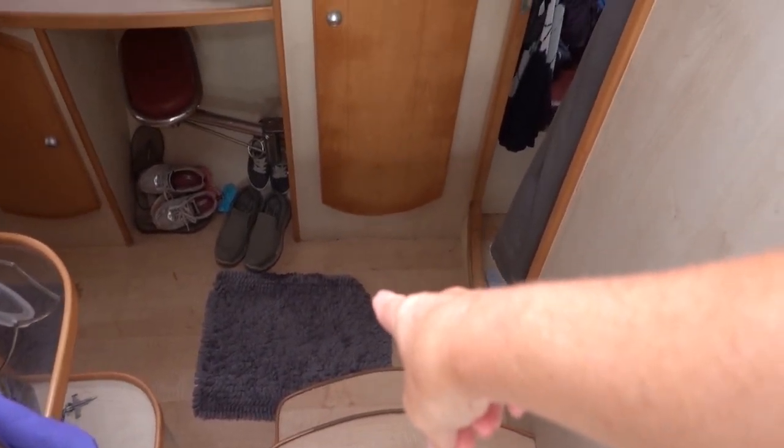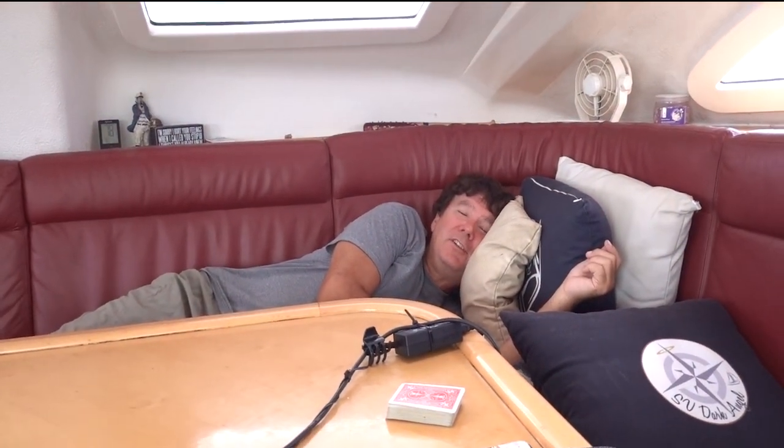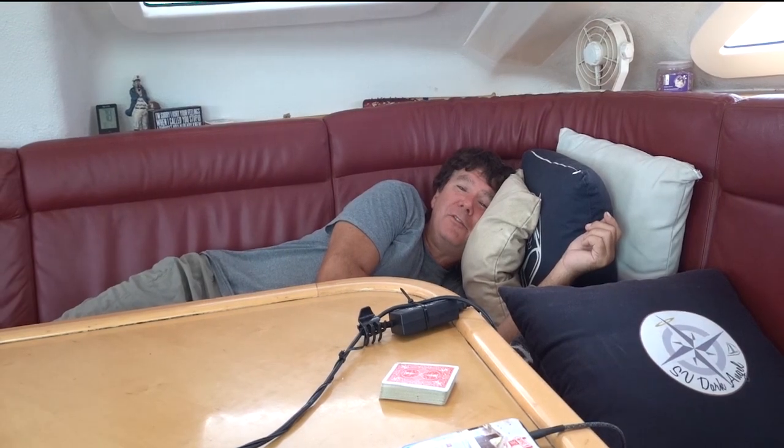Welcome to Sunday morning. This morning we have a project planned — we're going to be taking this bilge pump that was just chock full of water last night that I had to pump out. Dave is going to check the wires and make sure it's getting enough power. I checked the wires — there's not enough power. We have to trace the wires back to the source and find out why there's not 12 volts on it, and probably run a new feed.